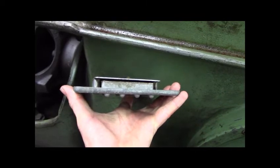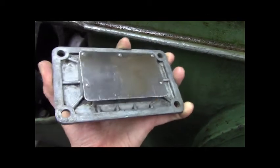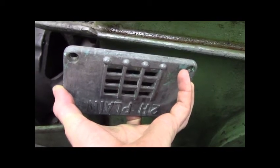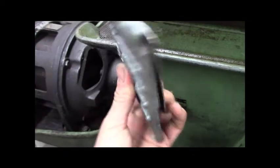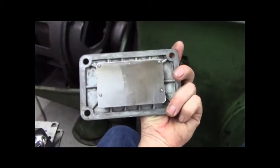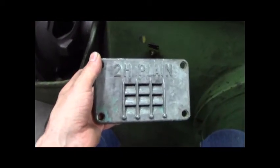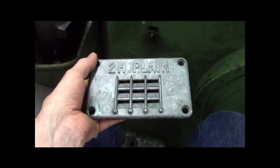There's a plate welded in — they're little tits that stick out of the casting and are spun down like a rivet. There's a plate inside with a gap at the top and a plate on the back with a gap at the bottom. So air can go in, up, over that plate, come down, and around the back of this plate. It's cast aluminum — definitely a die casting. I saved a couple handles off it. I think I sent a handle to a guy on Practical Machinist — just sent it for free, cover my shipping.